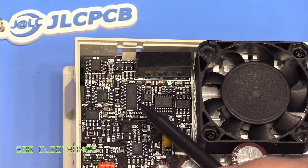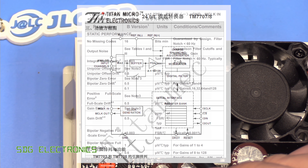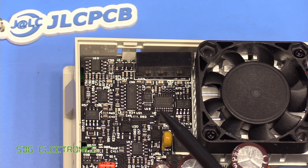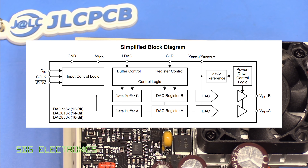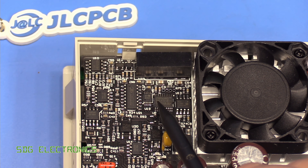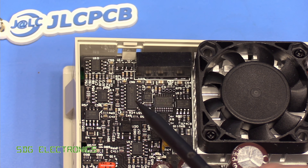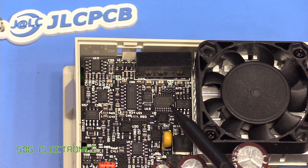We've got a Titan Micro TM7707, which is a 24-bit dual-channel ADC — that's where we're getting our readings from and it appears to be a fairly well-specced part. In terms of the actual reference, it's a TI DAC8582, a 16-bit dual DAC which also has a 2.5-volt reference built in, and that is what is giving us our accuracy. There's also a little 8-bit ST Micro controller, which I suspect interfaces with all of this and communicates to the rest of the board, along with a couple of opto couplers and what appears to be an isolated section with that DC-to-DC converter.